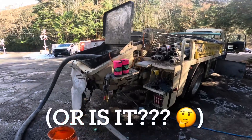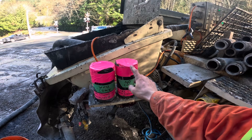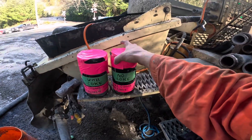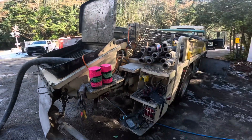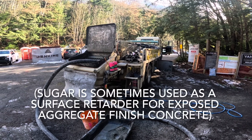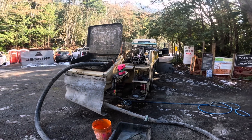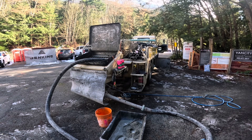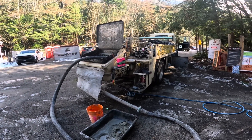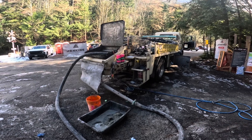We've taken our cylinders. I'm doing this so that we can show in a lab that adding Coke to concrete wrecks it forever. After 28 days — which is the testing and curing period — you're going to see this is going to have way less strength. This concrete is going to test out at 32 MPA, and I'm going to test at 35. I bet with the Coke in it, it tests out somewhere around 5 MPA. The whole point is sugar is never, ever intended to be used as a retarder. If you're going to use the concrete, you can't put sugar in it. Use something like a delay set or a Delvo. The minute you put sugar in concrete, it's garbage — it permanently affects the strength and structural integrity of the concrete. Sugar is a big no, unless you've got somewhere to pump the concrete out or you're going to wash out.